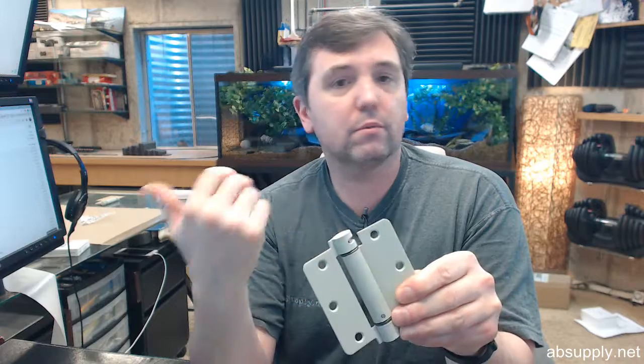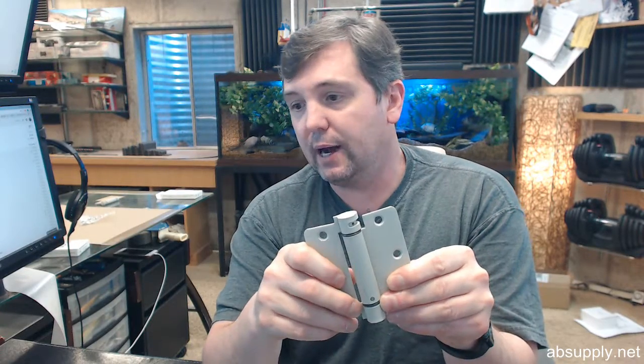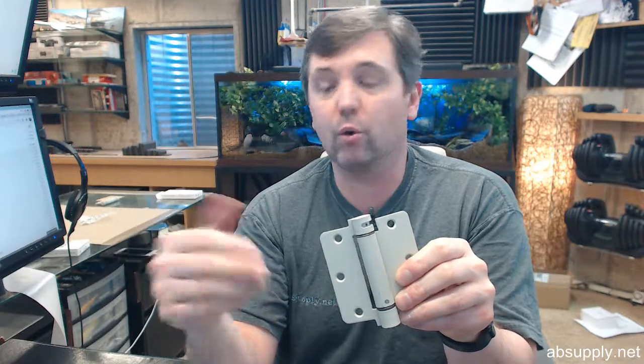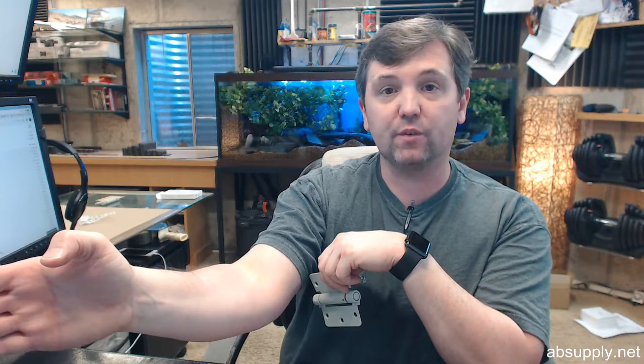If you're unsure, go with an additional spring hinge. If you're unsure and you try 2 and you needed 3, you can always order a third. Or 1 and you needed 2, you can always order an extra 1. That's just the bottom line, because when that door gets to 90 degrees, or even further, it has to overcome the dead stop nature of the door, the weight of the door, the size of the door, all the air resistance that it's going to move. Possibly the jamb is towed and it's actually technically lifting up like this, fighting gravity. So lots of applications.